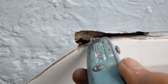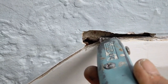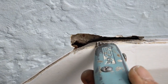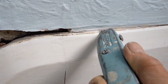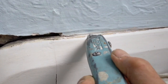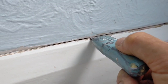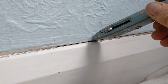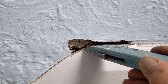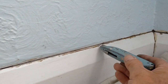When these older houses are constructed, the skirting board would have been in place before the plaster went on — the plastering is done after. The timber work won't be painted, and the plaster will sit on top of this. Over time it starts to crack. It looks like there's been a repair here because there's nice bright filler, and as we come along we come back to the old plaster and a bit of a gap — so that's running back to the brickwork.